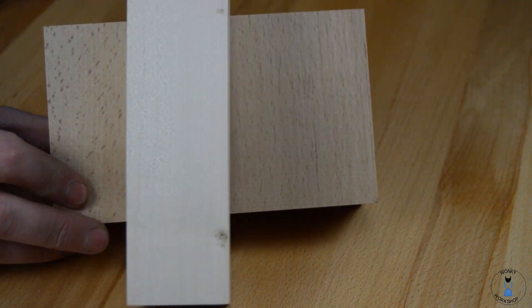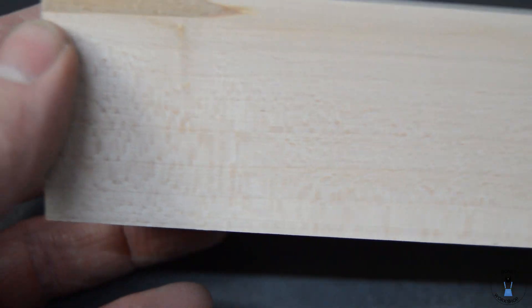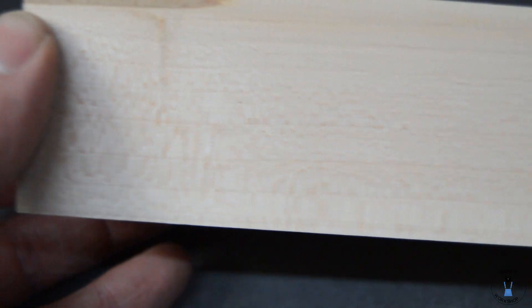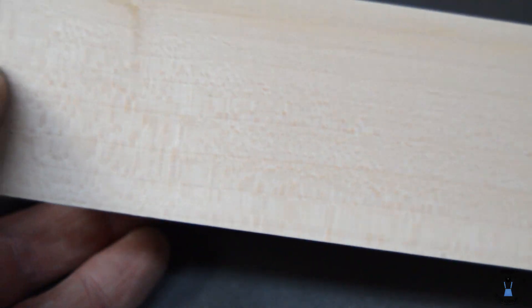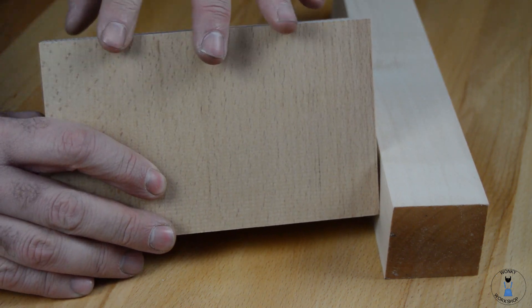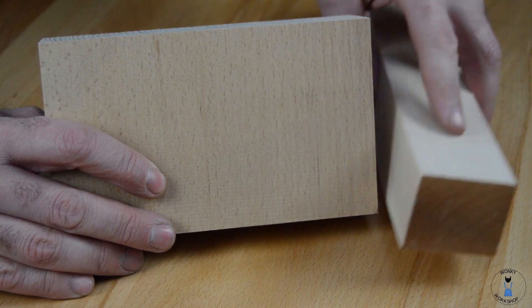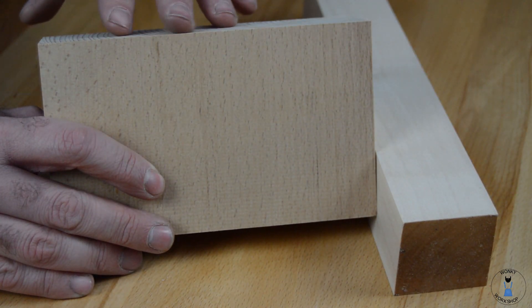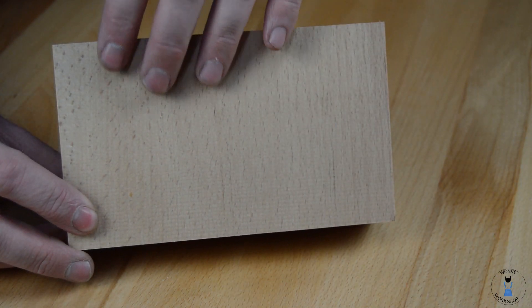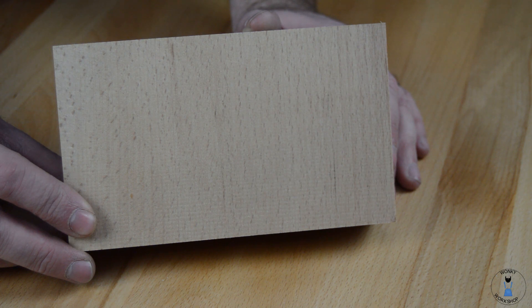The reason I've chosen sycamore to show you is because it sometimes has very similar grain patterns, but the flecks go the opposite direction and they're not very prevalent. This does mean that beech can quite often be used as an alternative to replace parts on furniture that may well have been made from maple — which is a similar family to sycamore — or sycamore itself. Beech is a very straight-grained timber, which leads it to be used for a very wide variety of things, not least workbenches, such as mine.